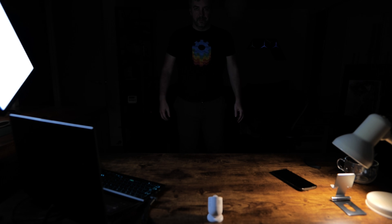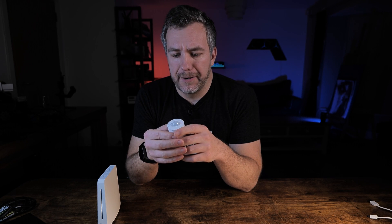I checked my iHost logs and confirmed that yes, this will trigger every 5 seconds. If you're in the same room, detection time might vary slightly — you can re-trigger it after 5 seconds if you meet the conditions, but if you continue moving, those detection times will be slightly longer, because as soon as you trigger it again before the previous motion has expired, it will simply extend the time showing you are within the motion detection window. Bear that in mind when planning positioning and troubleshooting your timeout settings.